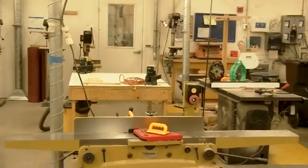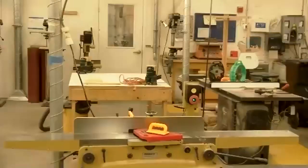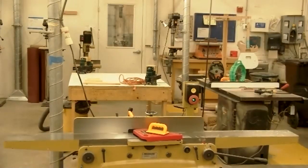We've gone over this before and I'm going over it again because it's that important. What we're talking about is basically what we call our order of operations in the shop — the order in which we move from machine to machine squaring the board. Getting a board square is not about getting it 12 by 12 inches; it's about getting all the surfaces 90 degrees to each other. Our order of operations is faces, then edges, then ends — which translates to thickness, then width, then length.